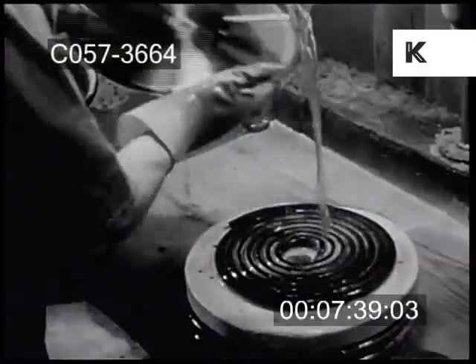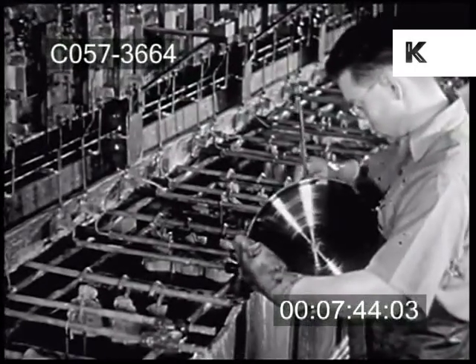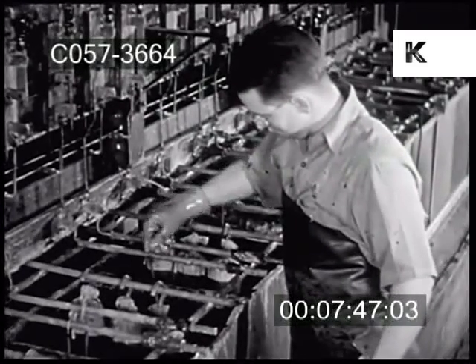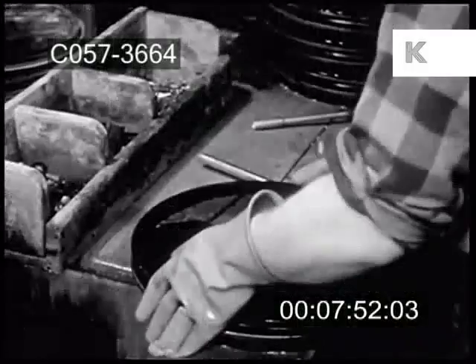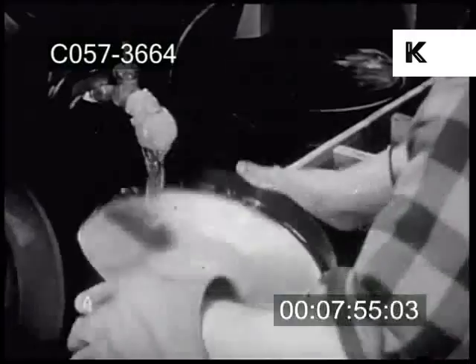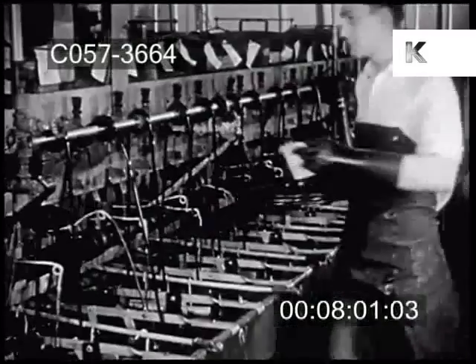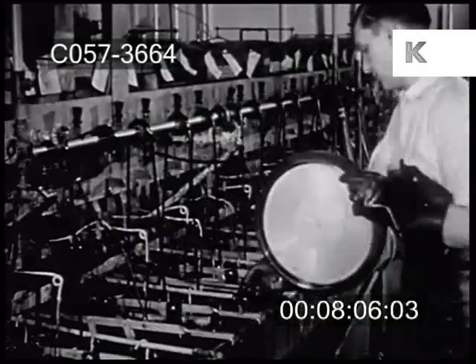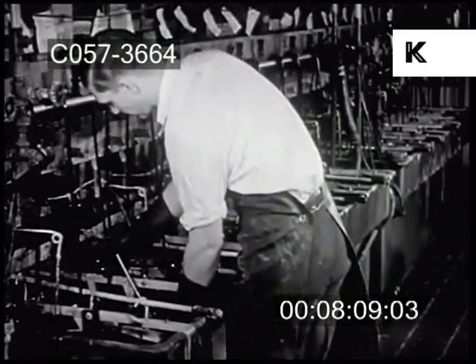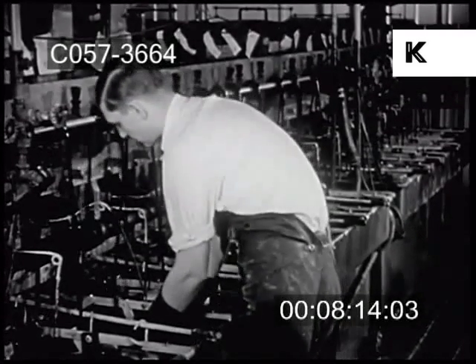The mother matrix is thoroughly washed and cleaned, and goes into a nickel bath to give it a more durable surface. After another washing and film coating, it goes into another copper bath where the stamping matrix starts to build up. The double disk bubbles in its bath until the tiny electrified particles of copper grow into a hard, strong coating, and the plating is finished.